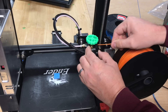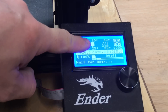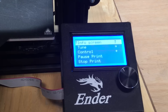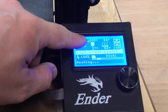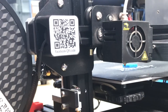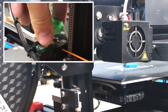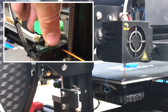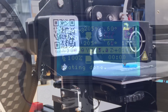The nozzle is going to have some blue filament still in it, so I need to heat it up. I go back to the menu, click the button to let it know I'm ready, click on the info screen, and now you can see it's set to 205 degrees — it starts heating up the hot end. While I'm waiting, I can start at around 170-180 degrees and crank out the orange until the blue changes to orange, get the proper color, get rid of the excess, and let it finish heating up.